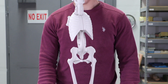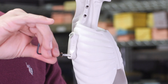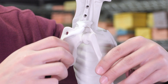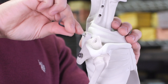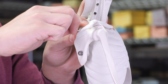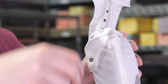Now to attach the arms to the axial, start by removing the bottom one and one-quarter inch screw from the standoff. Leave the top screw in place. Align the holes and attach the bottom screw loosely. Then rotate the arm and remove the top screw. Now align the top holes and attach the top screw through the arm assembly. Tighten both screws and then rotate the model so we can repeat the same process with the other arm.